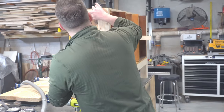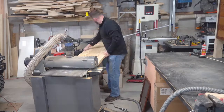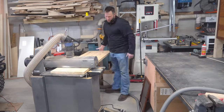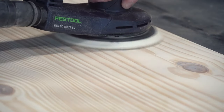I trimmed out the sides in the same pattern as the original buffet, just a little wider. For some reason I thought my planer was wider than it was, so when I realized the next morning that it wasn't by one half inch, I had to run the top through the drum sander to get things level. That little memory lapse cost me several hours of sanding.